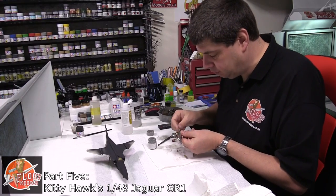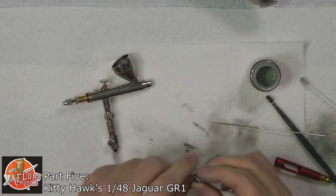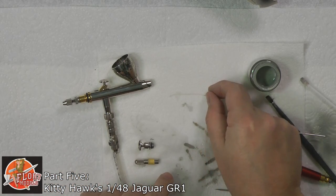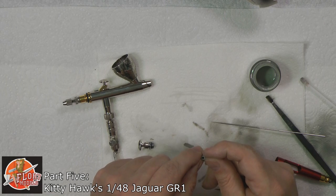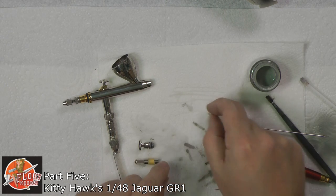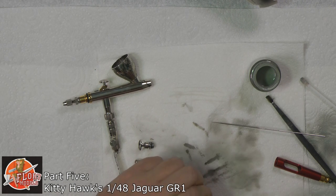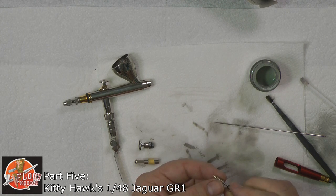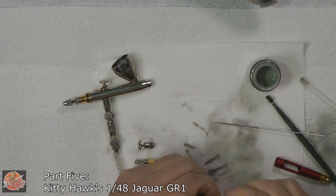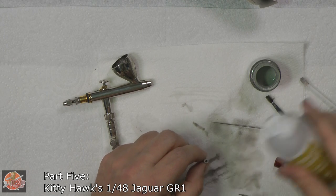So what you want to do, whip your needle out the back. Front end coming completely off. All right. And you want to have another look down here and give it a rub across the towel. And you can see the thinners coming out through the back. Okay. But you're looking down and we can't see any daylight. All right. So again, grabbing your reamer, cleaning it off, pop the reamer down in there, and you can probably see you've got a little lump of paint coming down, and this is one of those secondary bits that's come down. Again, we can't see daylight down through there.